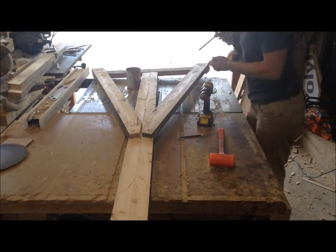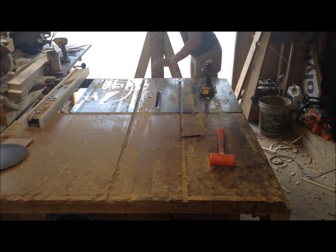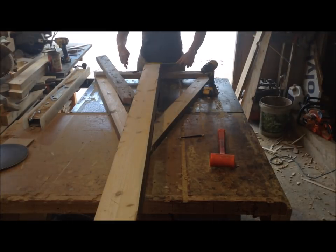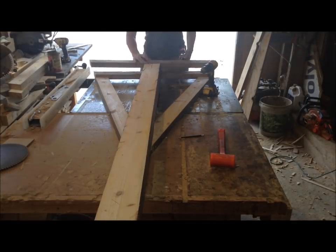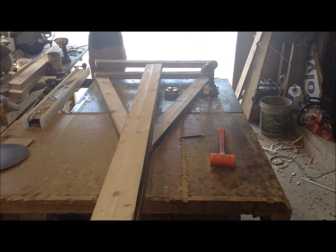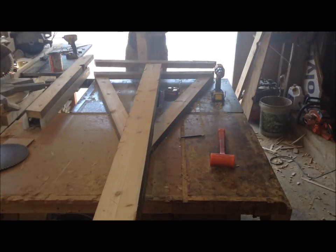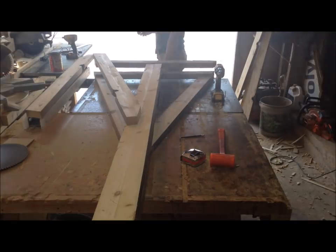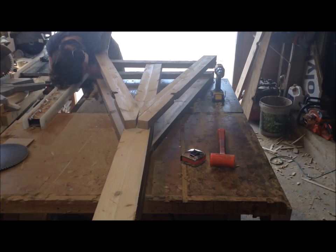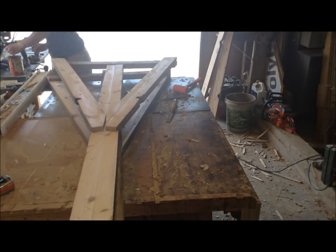I made two of these obviously to hold up the bucket — these are the sides. You can make these with butt joints; I would still cut that angle at the top, but I liked using laps because kids can be pretty rough with things. Making them does not take substantially longer than making butt joints. They were identical because I cut all my pieces on that crosscutting sled. If you don't have a neighbor throwing away lumber, with the approximate dimensions I have, you can make this with two by sixes and two by fours — they don't have to be the exact same sizes.